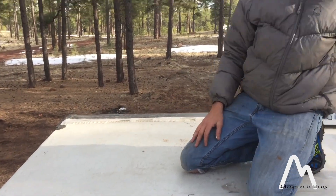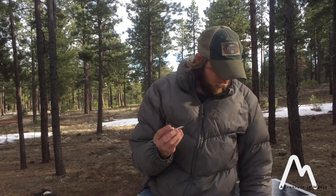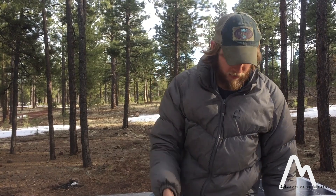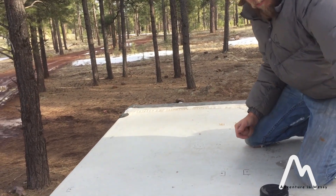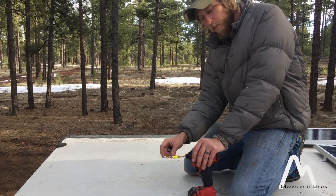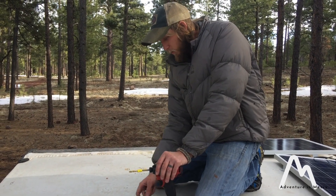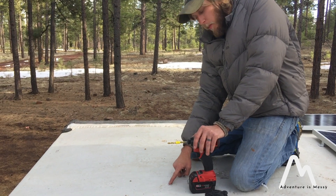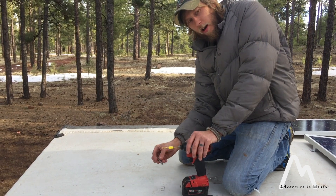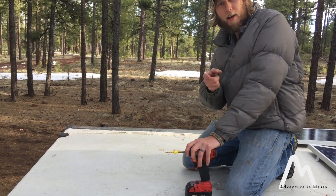We've already got our little z-brackets fastened on our panels. I had to drill these out just a little bit because I'm using some pretty heavy-duty screws. I think what's under this is like maybe half inch plywood at the most, so I wanted something with some pretty aggressive threads. What we did was we laid them out where we wanted them, marked around where the z-brackets were, marked the hole, and then used this drill. This is a little trick — when I don't want to drill too deep, I'll just measure what I really need the drill bit to go and put some tape around to stop it from going too deep. Now my next step is to put some silicone around here so when I lay the panels in place it forms a ring around the z-bracket. Then we'll put the screws through and silicone over it really, really well.